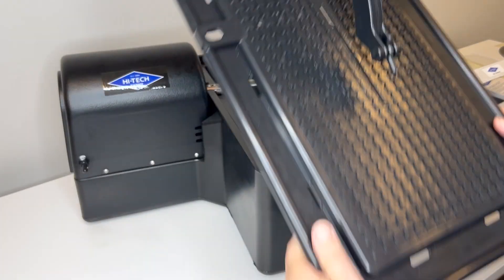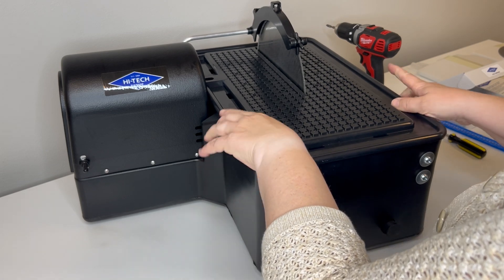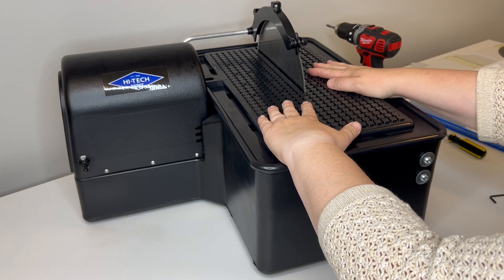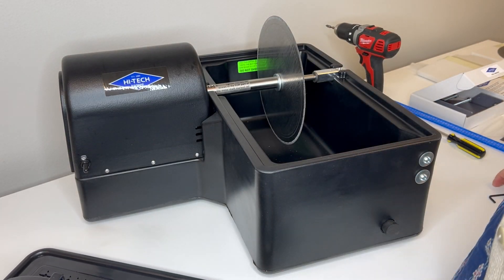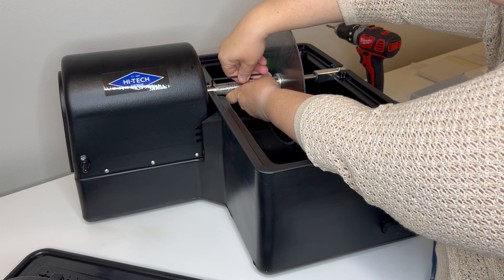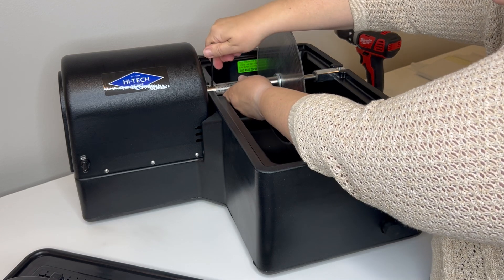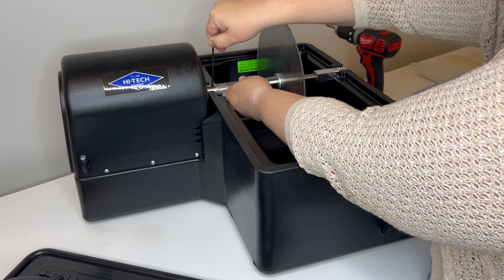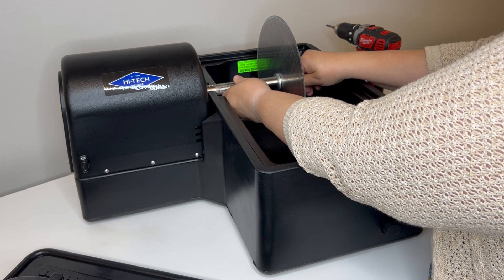Now I'm going to reinstall the table and check where I'm at. I'm too tight on the right-hand side, so I need to make an adjustment — there's a lot of room on the left-hand side. I'm going to loosen the set screws just enough to make those adjustments. Using the short end of the Allen wrench gives a little more purchase and makes it easier.